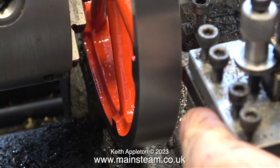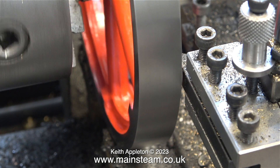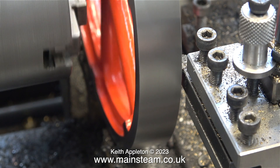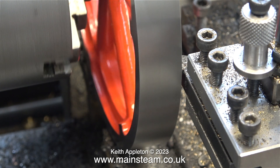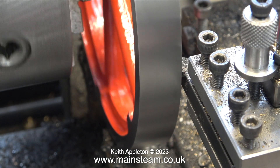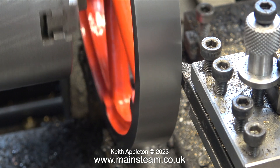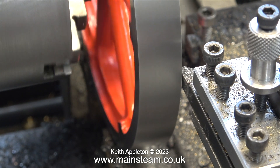That cut was actually okay, but I'm going to try and mess it up because this is a tutorial — so I'm changing the angle of the tool to see what difference it makes. These flywheels have some lugs cast in, and the strange noise being made at the moment is the cutting tool hitting each of these lugs in turn because I'm pulling it backwards. After the cutting tool stops cutting intermittently and reaches the solid contiguous metal, the noise changes but there's not much audible chattering.